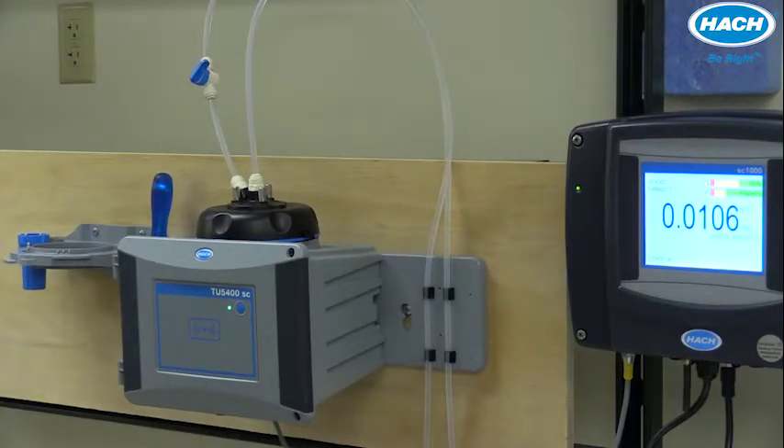Sample temperatures should be between 2 and 60 degrees Celsius. Maximum salt content should not exceed 3,000 microsiemens per centimeter. The maximum sample pressure depends upon the actual sample temperature — the higher the sample temperature, the lower the maximum pressure. If the sample temperature is between 2 and 40 degrees Celsius, the maximum pressure allowed is 87 psi or 6 bar. With warmer temperatures between 40 and 60 degrees Celsius, maximum pressure is 44 psi or 3 bar.